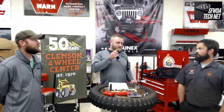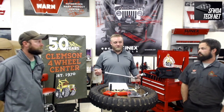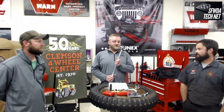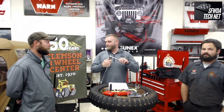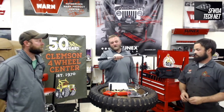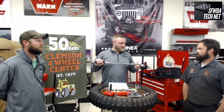When torquing, click it one time. If you go back and click it again, it will over-torque the bolt slightly, which could stretch a thread and potentially damage your stud — mostly used on wheels. Using an extension is okay as long as it's in line with the head and handle of the torque wrench. Never choke up on a torque wrench — it's designed at a specific length, and choking up won't give you the correct torque setting. Always hold right at the handle.